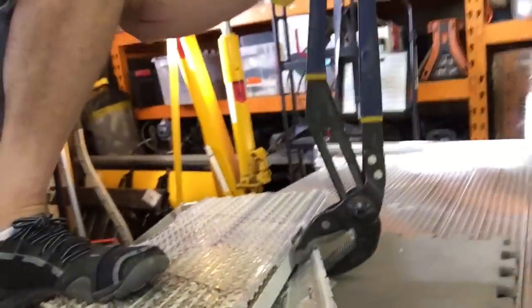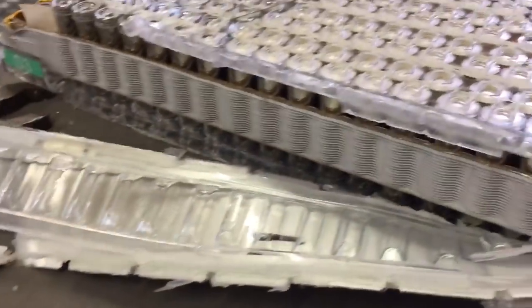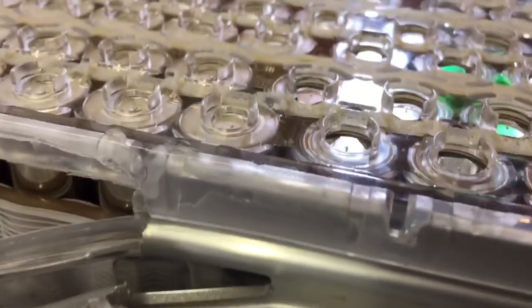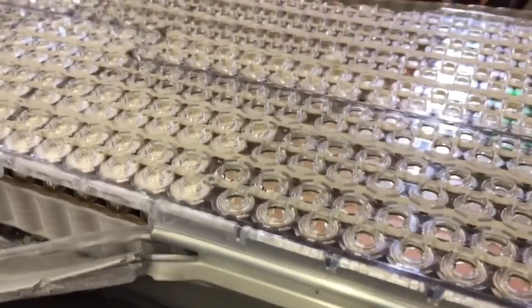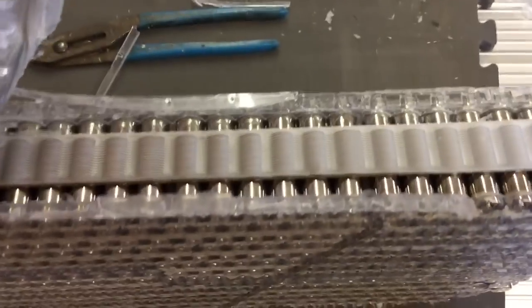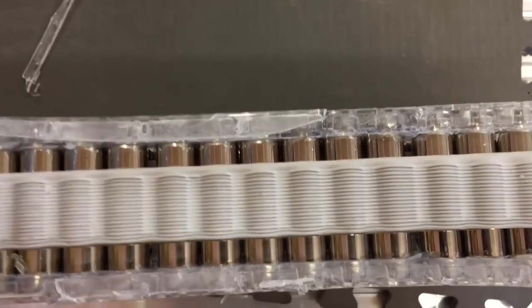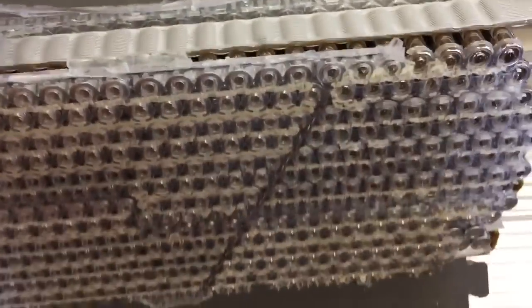This is one of the most difficult products I've ever opened — everything is just glued tight. I'm prying this aluminum side bar off and the metal would rather tear than this bead of plastic and glue give way. It must be polycarbonate because it's about the toughest plastic. From the side you can see that the cooling ribbon is nowhere near as wide as the batteries are tall, and the fact that it feeds from one end to zigzag back and forth out the other end makes me wonder how uneven the cooling or heating is, and if that's at all an issue.